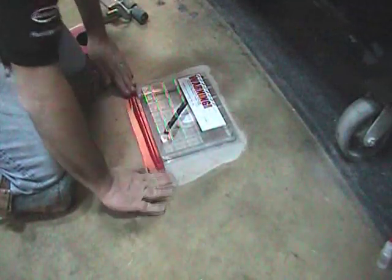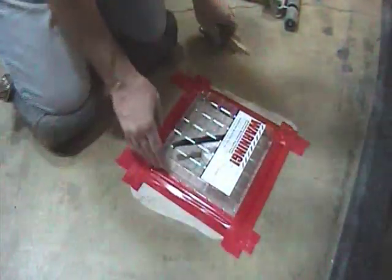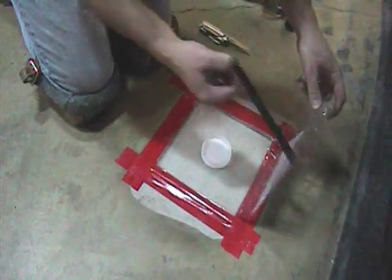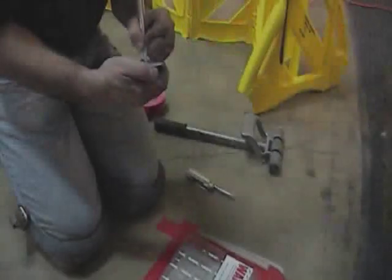After 60 to 72 hours, remove the plastic cover. The easiest way is to cut it open with a utility knife. Quickly replace the lid on the container and seal it with the original tape. Immediately re-weigh the container and record the new weight, time stopped, and test location on the container label.